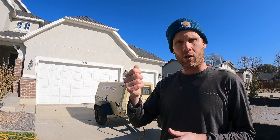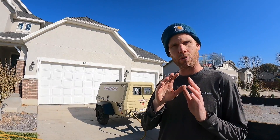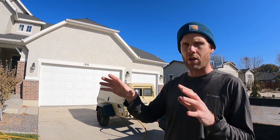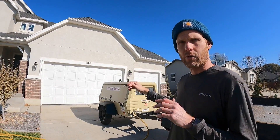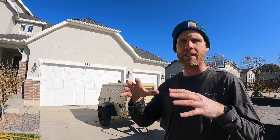The compressor is warming up and all the hoses are connected. Now we're going to go to the sprinkler clock — or your phone app — and run through zones one through however many you have. We'll open up the valve and turn on the sprinklers zone by zone, letting all the water get flushed out until we see air coming out of the sprinkler heads.